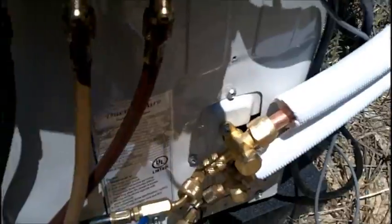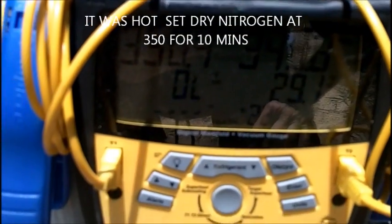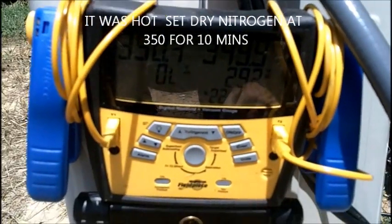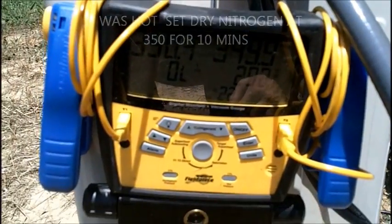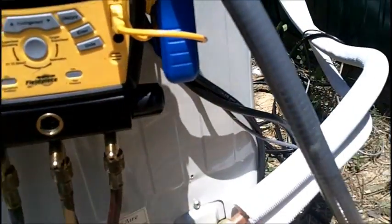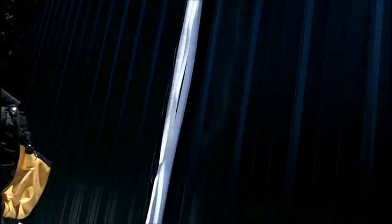I've got these torqued down, my gauges hooked to it, and my nitrogen tank hooked to that. We're sitting at 150 psi. With these digital ones they're about as accurate as something can get. It's been there for about five minutes and I'm going to keep it there for another five minutes to make sure nothing moves. Then of course I use big blue soap bubbles and just double-check and recheck everything. I'll bubble-soap this joint up here before I wrap all my lines up and make everything neat.